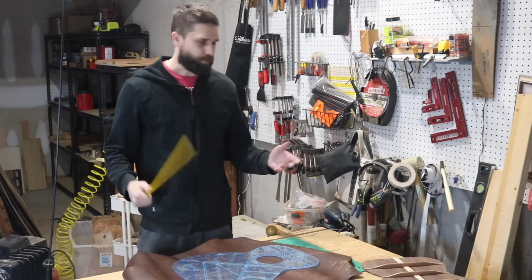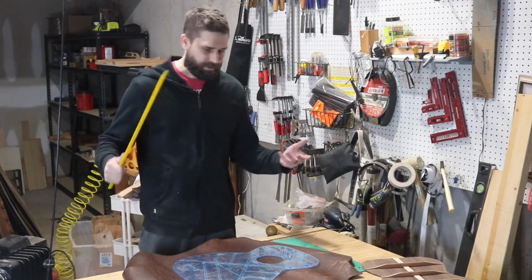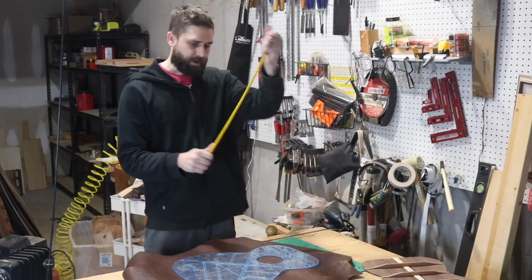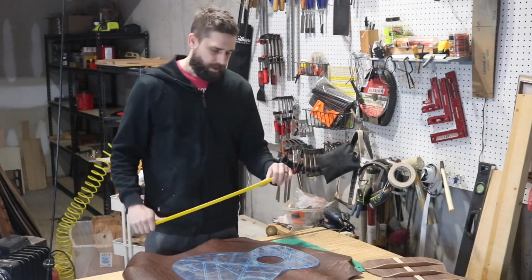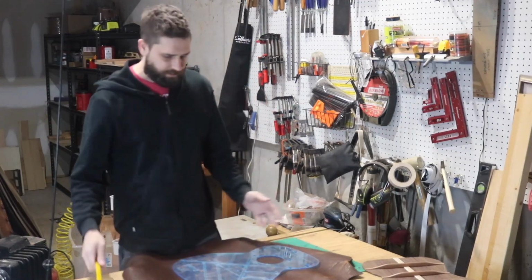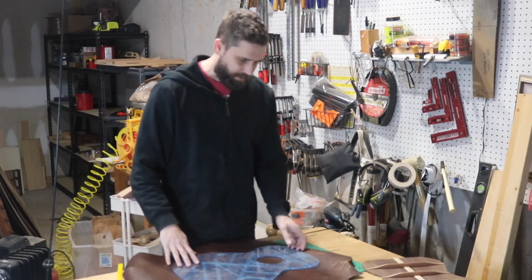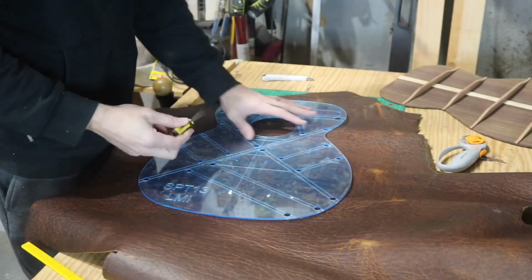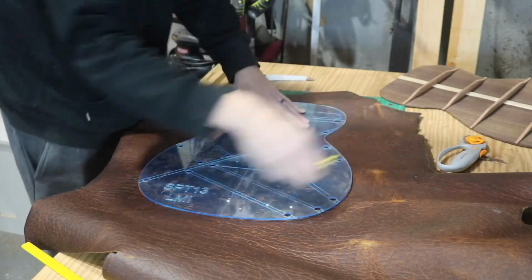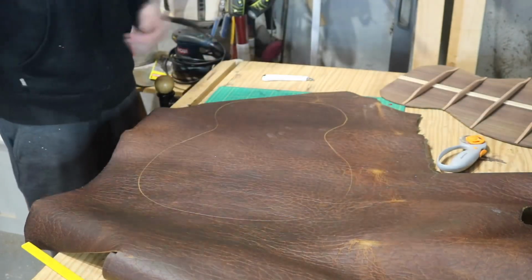I don't have enough clamps, whether spool clamps or regular clamps, to just clamp the back on, so I've got to use the go bar deck. What I have is enough go bars. I got some more go bars for my birthday last week, so I have enough to do the back, but I just want to protect it, so I'm going to cut a piece of leather out and try that. I'll just use this awl to scrape around this shape. There you go.